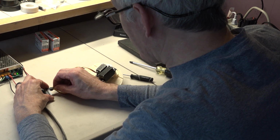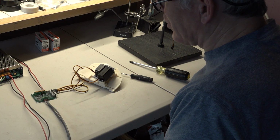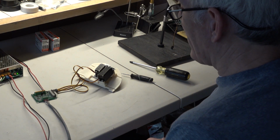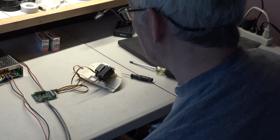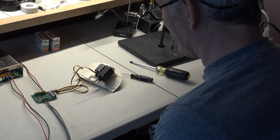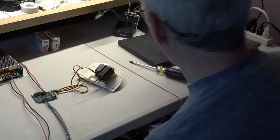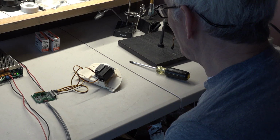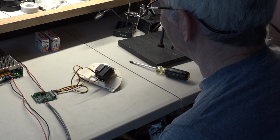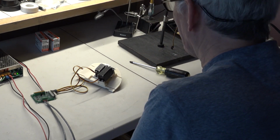Now you may have noticed that when you power this up, you can hear the servos holding their position, and it lasts about 30 seconds and then it stops. And that is a feature programmed into the controller board. And what that does is gives you extra life on your servos. So if it's not being sent a DMX command for more than 30 seconds, the board remains powered, but it powers down the servos. And it waits for a command. And as soon as the command is given, it starts moving the servos again. Within a routine that you're playing, I can't think of any occasion where you would have more than 30 seconds with nothing happening to any servo. So that usually doesn't happen. But if you leave the power supply on and you walk away for 6 hours, your servos aren't sitting there holding position and adding to their early demise. They've got a certain amount of time as a lifetime, and then they're out of it. So that's what's happening there.